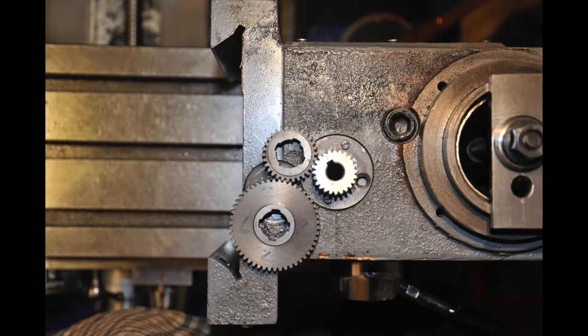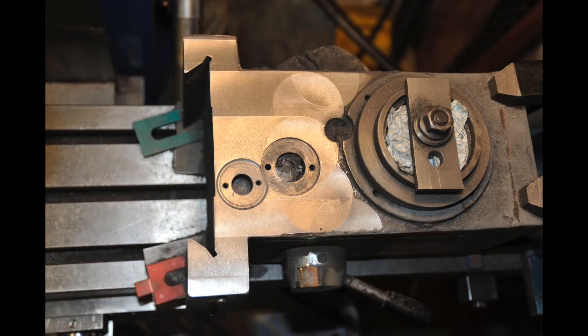I've strap clamped the headstock to the mill using the machine spindle faces for alignment, then packed up underneath with shims. The spur gears are sat there to get an idea of what we're aiming for. The first machining process was to deck it to give me a flat playing field. The cast dust is gritty and horrible so we've sealed everything up as best we can, but the casting is good.